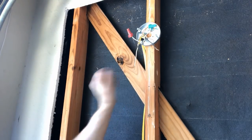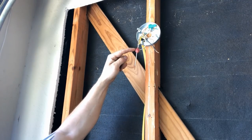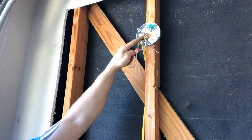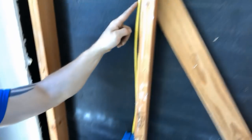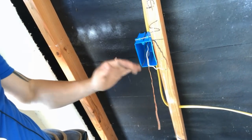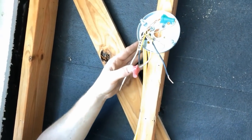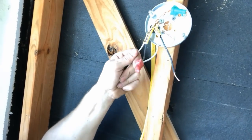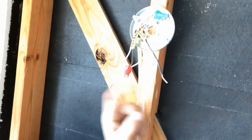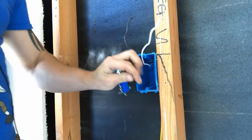What we have left is a black and a white wire to hook up to the light fixture. The incoming hot is now wire-nutted with the loop white wire, so that white wire carries hot all the way down to the switch box. The black wire is the switch leg that comes back up to the light. The incoming neutral — the white wire labeled 'power' — goes back to the panel. So we have a hot and a neutral left over for the fixture, and the wire nut joint gets moved out of the way.